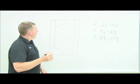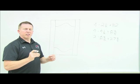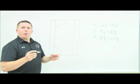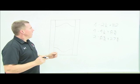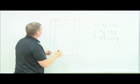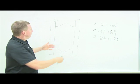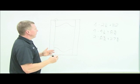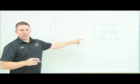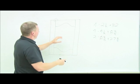Here's the part that gets a little complicated. In beginning classes, students make all their doors to ideal size and they end up a little bit smaller, which is okay because of the half-inch overlay. But for advanced builders, if you build them exactly to this size, there's no way to glue them up so that the joints are perfect — you have to shave the top and bottom. Even if it's perfectly parallel when you put it together, it still ends up being slightly smaller than intended because of the shaping.